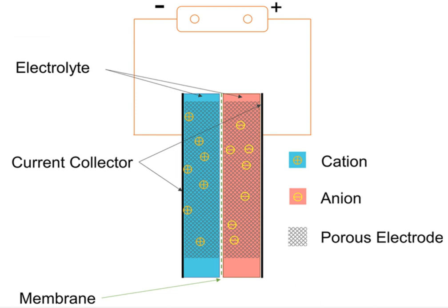Such electrodes also employ electrochemical doping or dedoping of the polymers with anions and cations. Electrodes made from or coated with conductive polymers have costs comparable to carbon electrodes. Conducting polymer electrodes generally suffer from limited cycling stability. However, polyacene electrodes provide up to 10,000 cycles, much better than batteries.